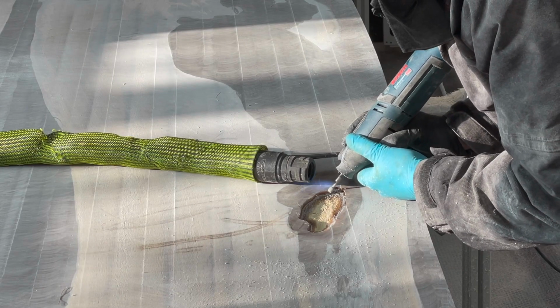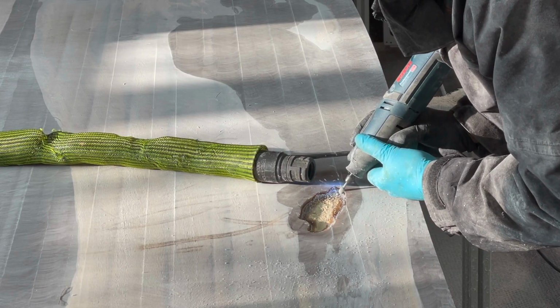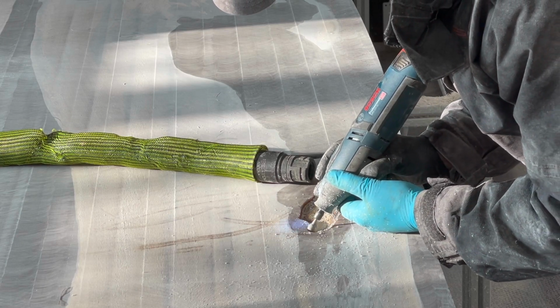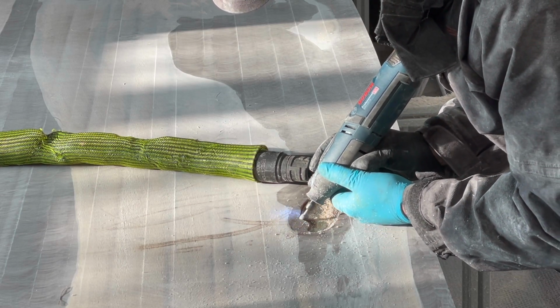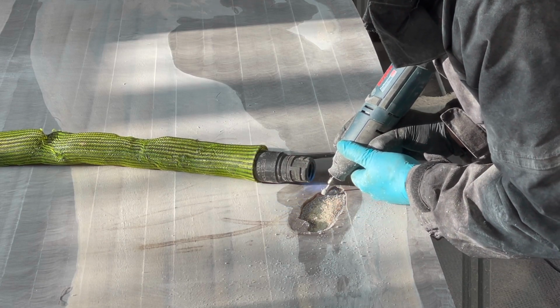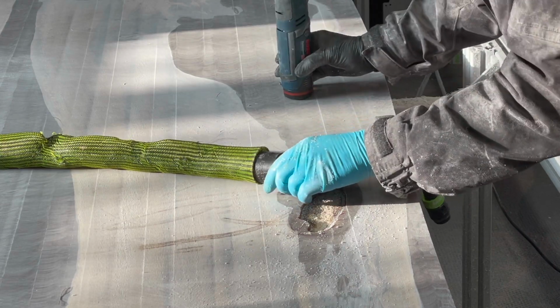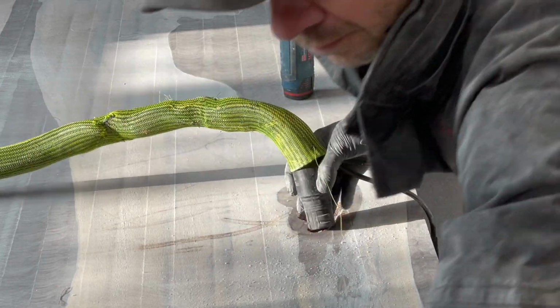So small defects on the bottom aren't really a problem, but you do sometimes get these large pockets just where the resin couldn't run under. It's my mistake. I should have taken more material off so that there was no bridge between these two holes on the underside, but it does happen. Just Dremel it out, then re-pour the resin.